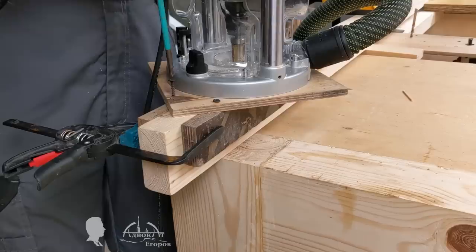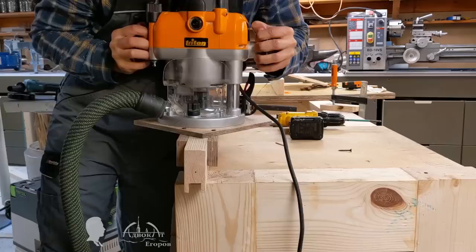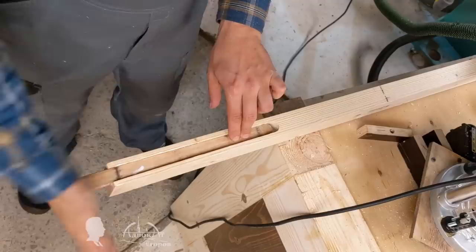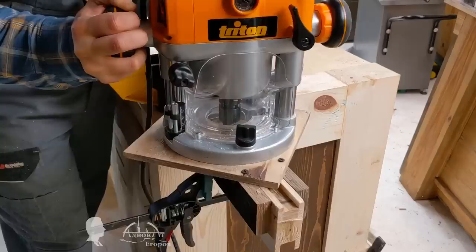The joint reassembly must be flush with the guide beam. The simplest solution for this goal is to mill grooves for two holding planks. I hastily assembled a milling jig from scraps of plywood. It is important to make two passes when milling a groove — the second pass made by turning the router jig 180 degrees, so the groove is guaranteed to be perfectly centered regardless of the jig's accuracy. I messed up the first blank by milling the groove deeper than planned, so I glued in an insert and milled the groove again.